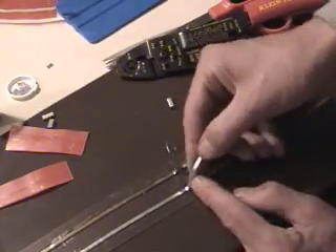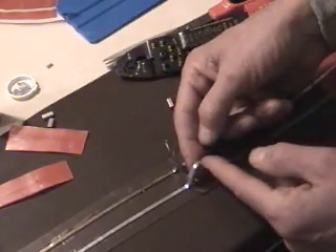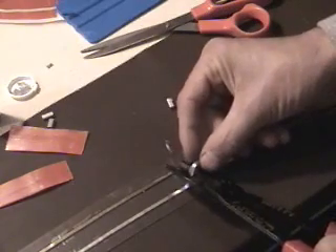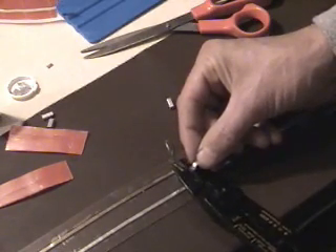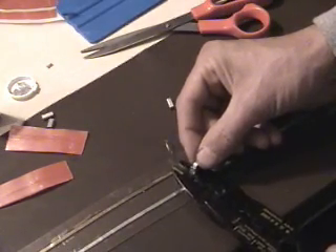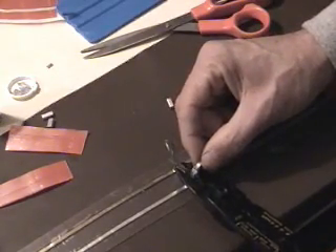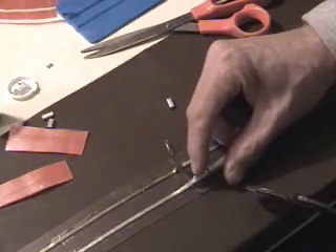You are going to bring the crimp almost all the way down to the bottom of the tape. You can put a slight bend in the wire right here, and that will retain the crimp's height and location. You are going to hit it first in the middle and then on the top with the crimpers. As long as you stay in the middle and not down towards the bottom, you don't have to worry about getting that wire down there. You stayed a good distance away from the bottom of the crimp.